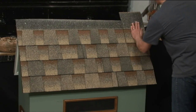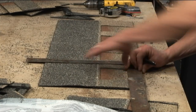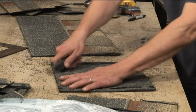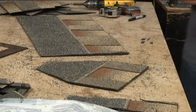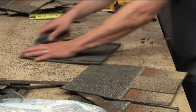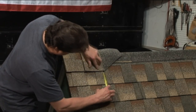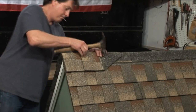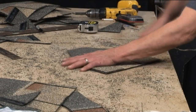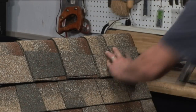Do the shingle application the same way on the other side. For our top tabs, measure 12 inches from the end of the shingle, cut, then turn it over and give yourself a small angle cut on both sides of the top. Make sure you have a nice clean cut edge — make enough tabs to span across the whole top. Center your tabs on the top of the roof and nail in with ¾-inch roofing nails, keeping the same distance all the way across from your last row. To finish your roof capping, cut the black part off of the tab, nail it in — the nails are exposed, so stab them with some clear caulk.